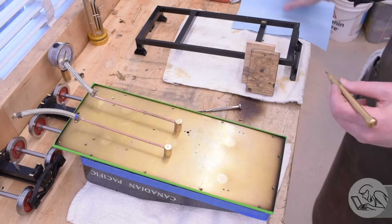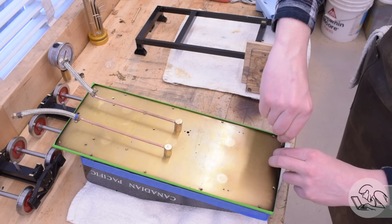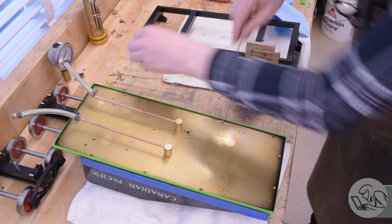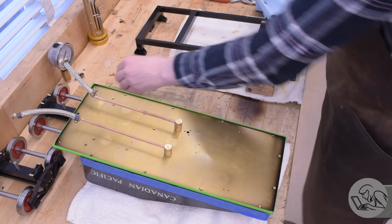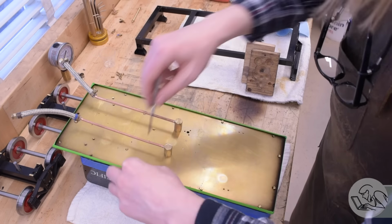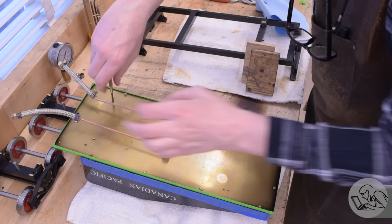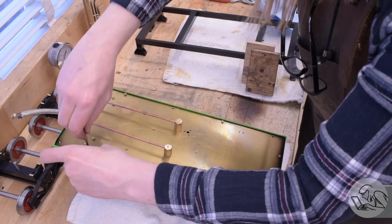It's worth noting that my order of assembly is different than Kozo's. He would like you to do everything that you're seeing me do through the maintenance hatch in the top of the tank. So he has you put the tank on early, and then all of the pump connections and everything are made from above. That does make sense because you have to put the tank together before putting it on the frame, because the frame covers all of these tank screws that you see me installing, and those hard lines that you see install under the frame, so there's a dependency there.